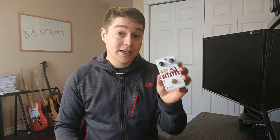So now for sub-octave pedals. Sub-octave pedals have to divide that input frequency band by either a factor of 2 or 4, etc., to get you one octave, two octave downs, etc. This is usually done by some sampling and the use of flip-flops to divide your signal. And in the case of the MXR Blue Box, that's exactly what's going on.